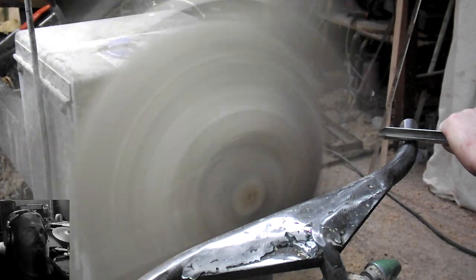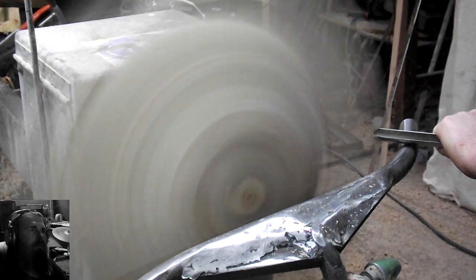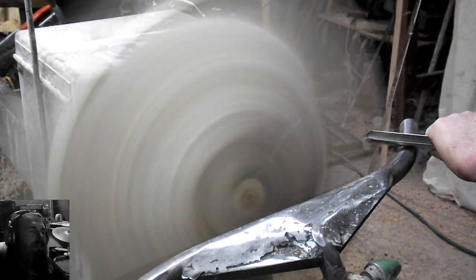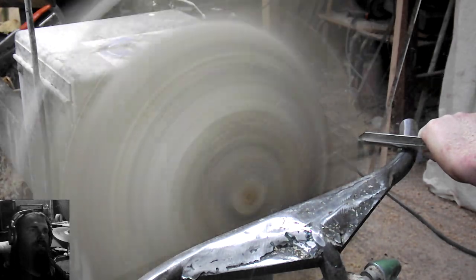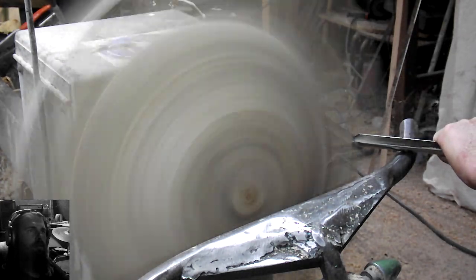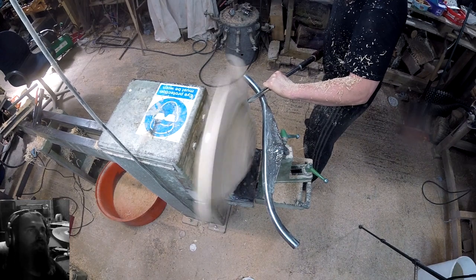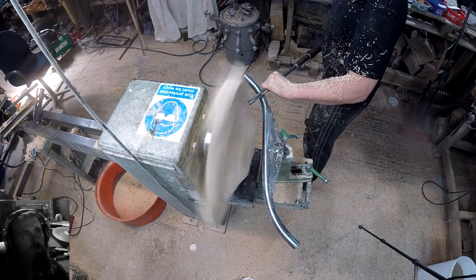Now it looks a bit out of balance, maybe a bit off centre, but actually it's pretty much in balance. It was quite wide at one end and thin at the other. And I did my method of putting a spike in the vise and balancing the piece on the spike till it found the centre, and that's what I used as my centre point to drill my mortise. So yeah, even at 800 RPM with no turning done to the piece, it was pretty well in balance.